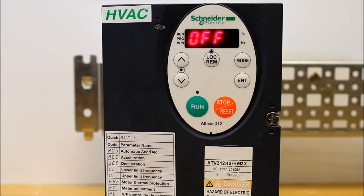On your display now, when you go back to your main menu, it will show OFF because right now the run command is not made. The OFF is a normal state telling us that we are in a run permissive state, which means that you actually have to give it a run command to let it run.